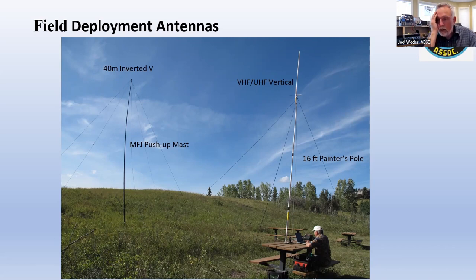Digital modes like WinLink can have a pretty high duty cycle, so you can heat up an antenna if the SWR is really high and its little transformer is working its tail off. My little ICOM tuner does the work here and it doesn't complain at all.